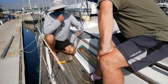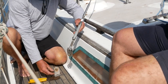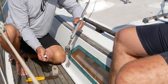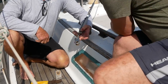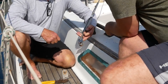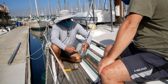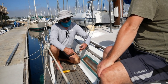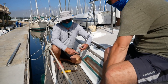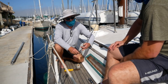It's a half-inch turnbuckle, but the pin hole for your chain plate is five-eighths, so that's a five-eighths pin. Take a look at what's been done here — it's kind of washed out and rounded. This doesn't make it really any stronger, and in fact that's not much tear-out. What you would like to see is close to the diameter of the pin as tear-out as well.